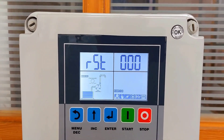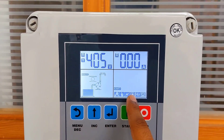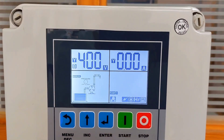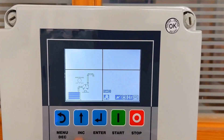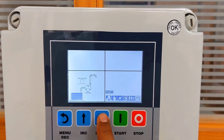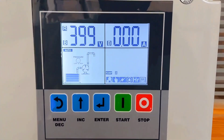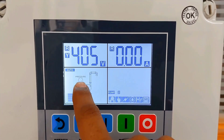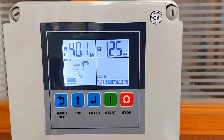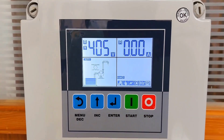To switch to auto mode, press the menu key twice so the hand symbol blinks, then press enter. The 'manual' indicator blinks — press the up key so 'auto' blinks, then press enter. The system is now in auto mode. You can see the bottom tank is full and pump one pressure switch is low, so the pump is now running automatically and drawing current. The pump running status is visible on the display.